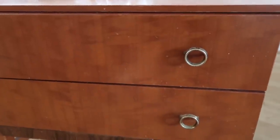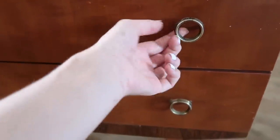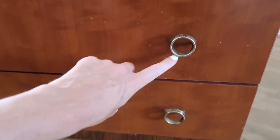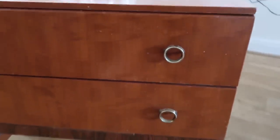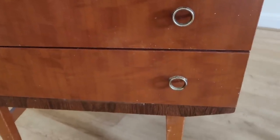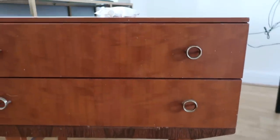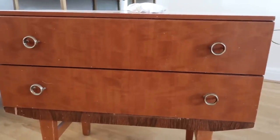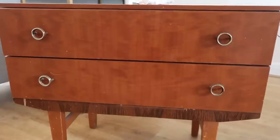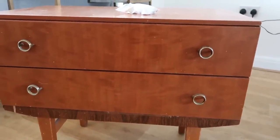When I sand the whole unit I'll take the handles off, sand the drawers, and drill the new holes. I may use the two inner holes on each drawer and filler the outer hole, but I want the handles centred to the legs which would look neater. So I am going to filler and drill completely new holes — I need to do a really good filler job, sand those back, and make them beautiful and flush so when I paint the drawers you're not going to see the holes.